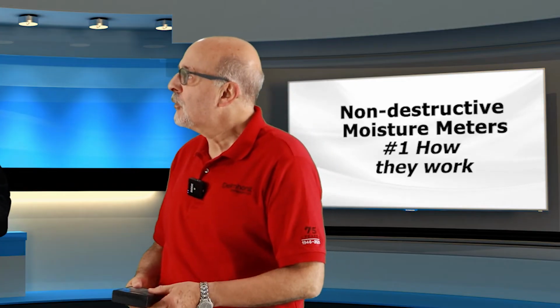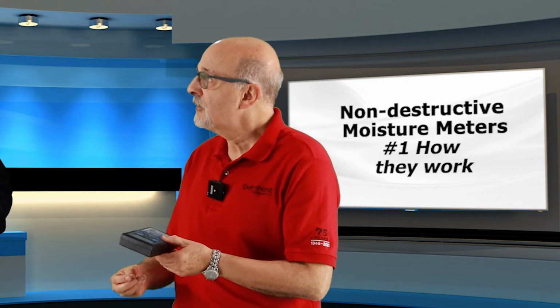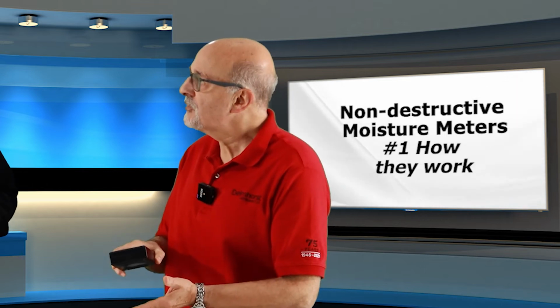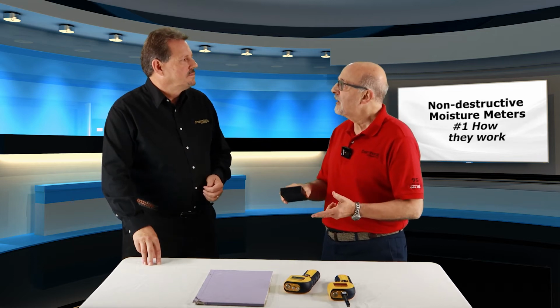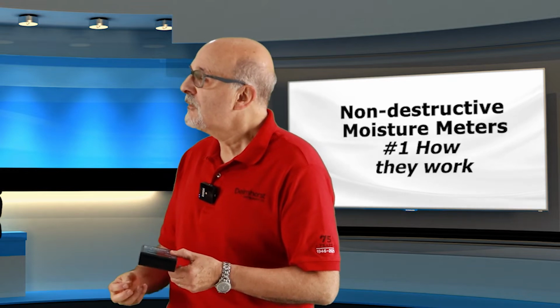So the way these meters work is that a radio frequency signal is sent into the material. The deeper that signal goes, the weaker it becomes. So in effect, it's reading the moisture closest to the surface. Gotcha. Which makes them useful for taking quick surveys of an area to find out where your high moisture spots are.